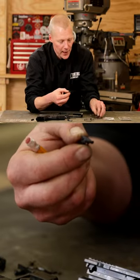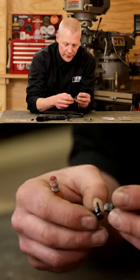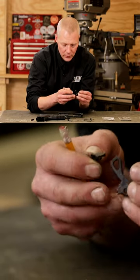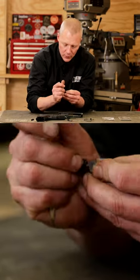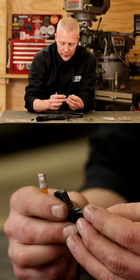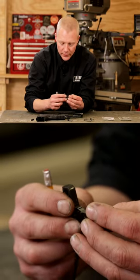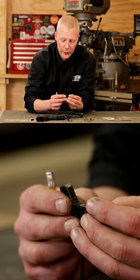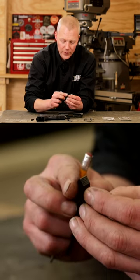Slicking up a couple of these parts — the sear and the hammer. The sear and the hammer interact like this in the right orientation. There's a little notch in the hammer where the sear holds it back, and as that trigger is pulled, it pulls the sear away from it and allows the hammer to slip forward.